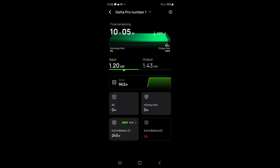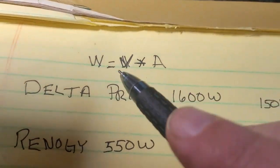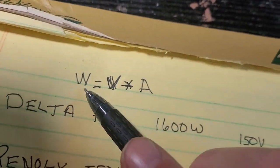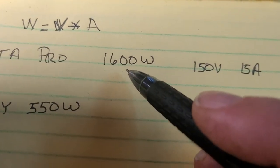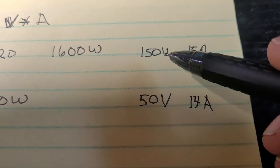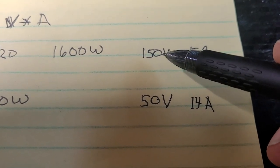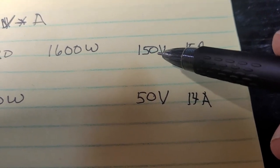Let's look at some numbers for the solar panels — a quick fun with numbers. The important formula here is that watts equals volts times amps. The Delta Pro solar generator has a maximum solar input of 1600 watts — if you feed it more than 1600 watts it'll just accept 1600 as a cutoff. It also has a maximum solar input of 150 volts, and that's a hard number — too many volts can cause an electrical problem, maybe a short or overload, and in a worst case it could destroy the unit.